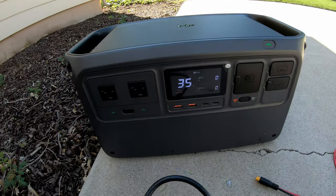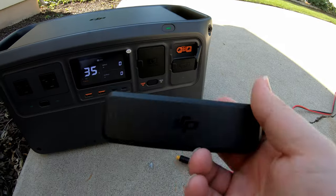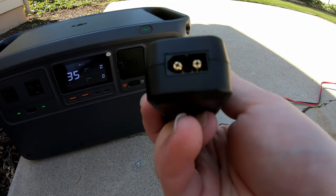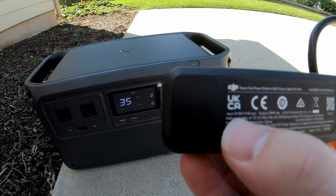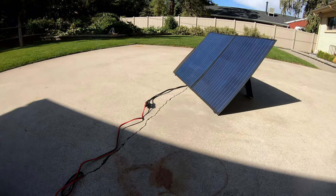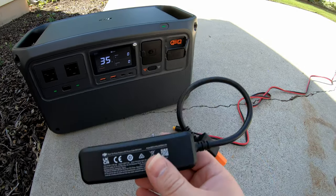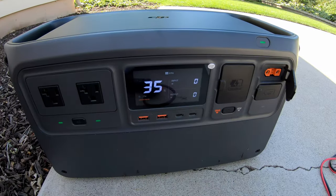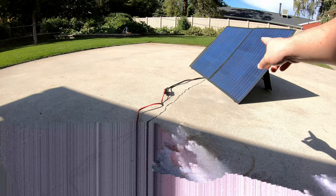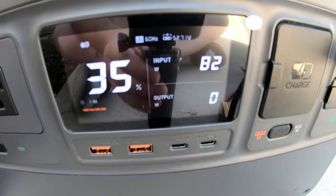I'm curious: to get solar into this unit you need adapters for the SDC ports. The included car charger has an XT60 plug and a voltage range of 12 to 30 volts — enough for a 100-watt solar panel. Could this dongle serve dual purpose for both car charging and 100 watts of solar? That's a 100-watt folding solar panel. Plug the XT60 in, getting a green light, now plug it into the power station — lookie there, 82 watts. So this can be used for multiple items.